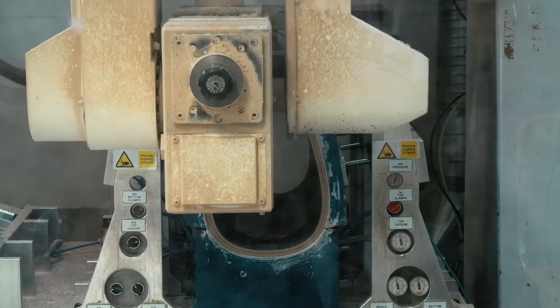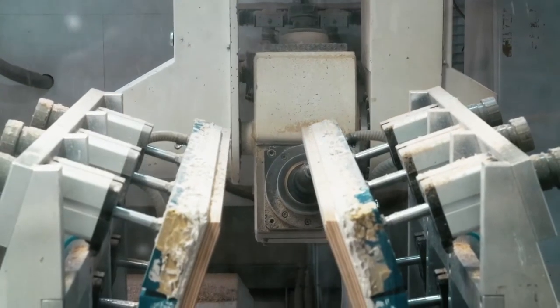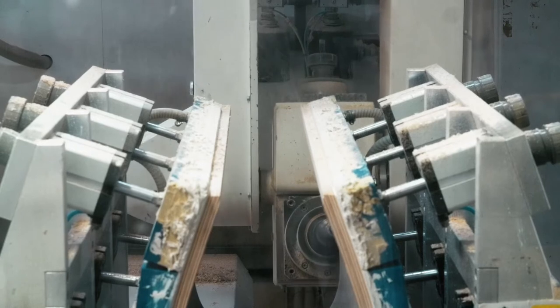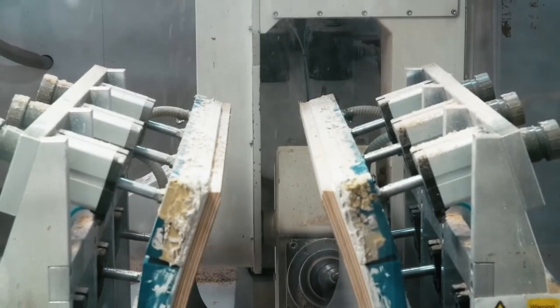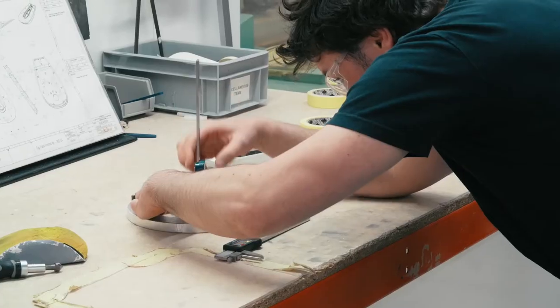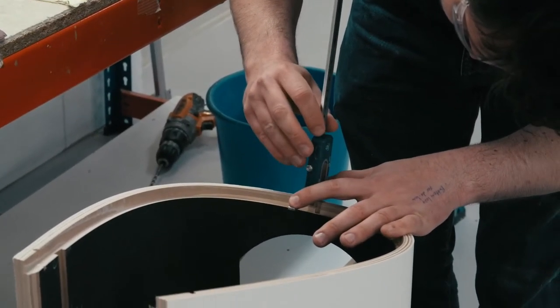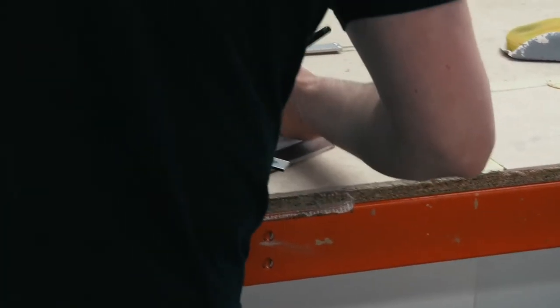After we've taken the cabinet from the press tool, the next thing is to bring it to one of these — a five-axis CNC cutter, a robot cutter. What we're doing is cutting away all of those rough edges formed on the press tool to create something we can build into a complete loudspeaker cabinet. It's really important at this stage that the cuts are as precise and accurate as possible, because we're joining that wrap form to other elements including tops, bottoms, and internal component parts — which can be made of wood or metal. Our cutting accuracy is plus or minus 0.2 of a millimeter.